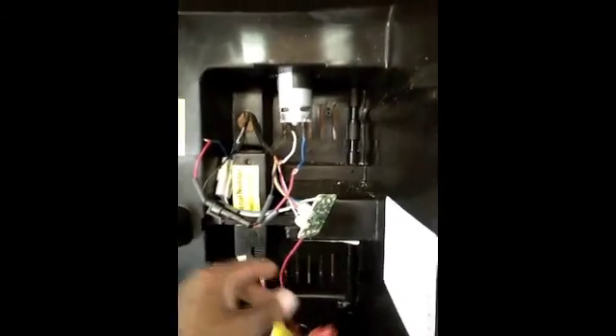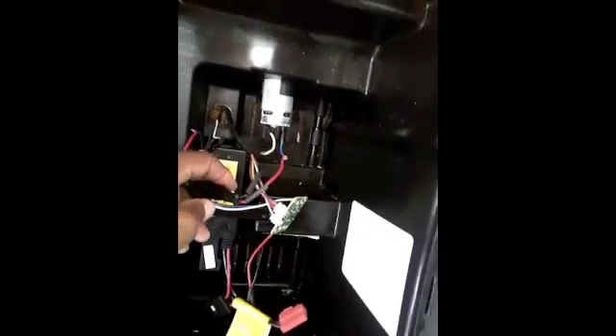Got some more parts in the mail — these were connectors I ordered a while back and it took forever to come, so I was kind of waiting on those. Doing some wiring, I got some shrink wrap and you can buy that shrink wrap at Home Depot. I've just been soldering — basically putting a connector in line with the motor, and I already got a connector for the power, so I was tapping the power source.